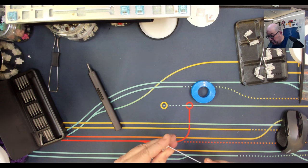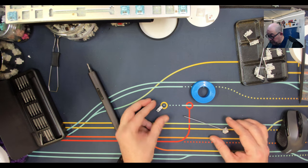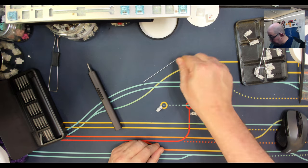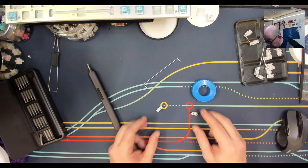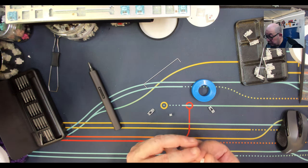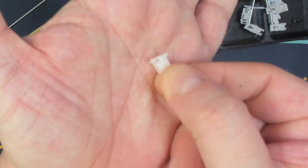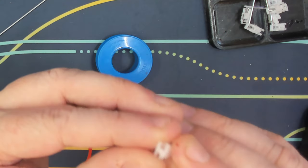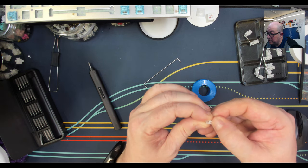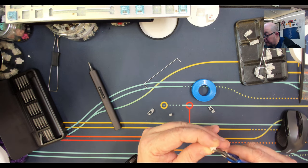I just want to slow down one of them to help anyone that's actually starting out. As you can see, these appear to be completely bone dry. So it looks like they were sent by Eyooso, bone dry. I'm going to go ahead and flip these out. Now for clipping the legs, I don't know if you can see, but there's tiny little feet right here that are sticking out. Here and here. Actually this one has more of a tab, but both of these can go and your stabilizer is going to tick a lot less.